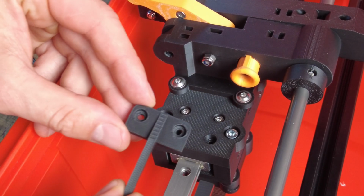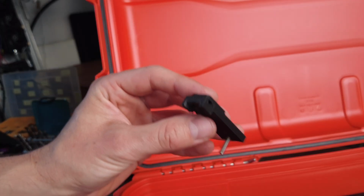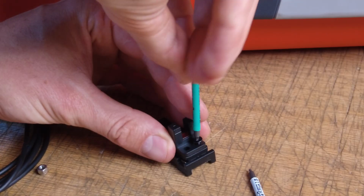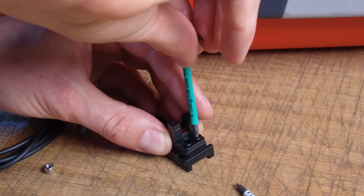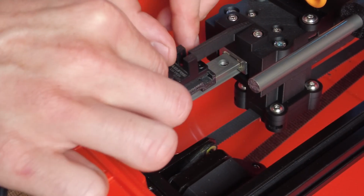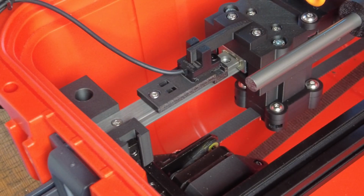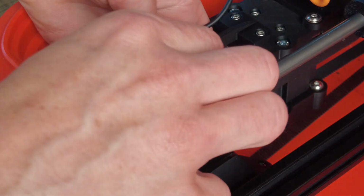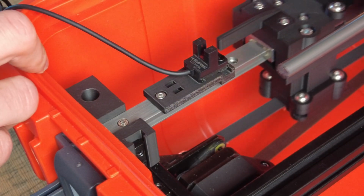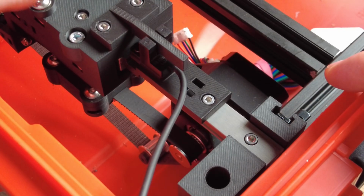The last part for today is the end stop. I choose a simple 3D printed piece that can easily be replaced later in the project. I will fine-tune the dimensions once the platter is installed. The end stop sensor gets a small 3D printed base that screws onto the linear guide rail. With that, all parts of the feed carriage and lever arm are finished, at least for now.